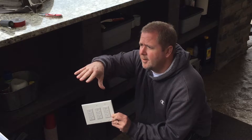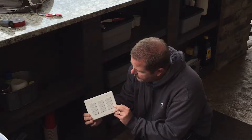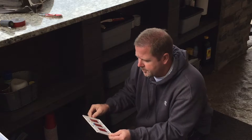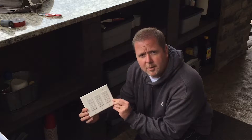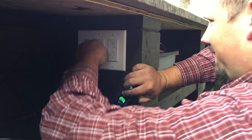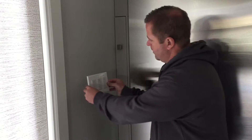We're ready to mount the wall switches. There are three switches we're going to install: one controls the bar, one controls the under-capstone accent lighting around the driveway, and another controls the capstone lighting out by the pool. You have a couple of options to mount — you can screw the wall plates into the wall or simply use two-sided tape, which is what we've chosen here. To get the alignment right, we've mounted the wall switches to a standard three-gang panel plate and we'll stick them on the wall. We're using double-sided tape for the second set of switches controlling the three controllers outside as well.